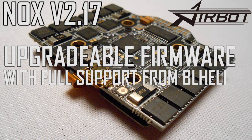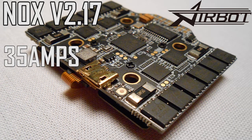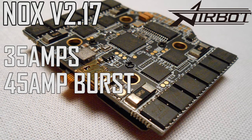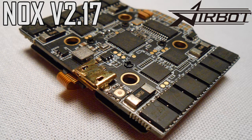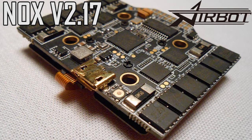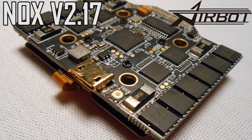These ESCs are also able to give telemetry for things like current, temperature, and RPM. They're upgradeable on the NOX version 2.17, and going forward, BLHeli is going to be providing firmware updates for all the ESCs on the NOX. The ESCs are rated for 35 amps, and although Airbot doesn't specify a peak amperage rating, we could expect to get a peak of about 45 amps for short bursts — more than enough for just about any motors you want to throw at them. This board has a limited VTX power supply and small 20x20 mounting holes, so it seems clearly intended for an ultralight or micro build, but the ESCs can handle much bigger motors, so I think we can expect to see something really big from Airbot in the future.